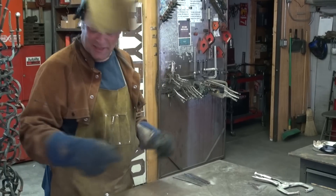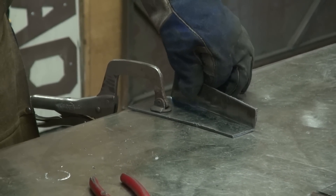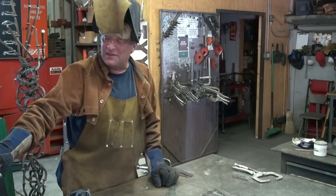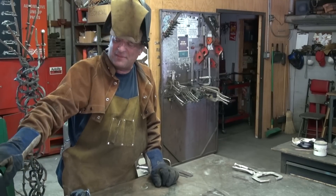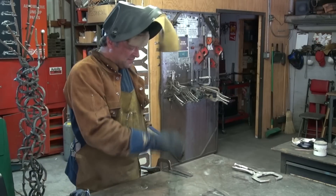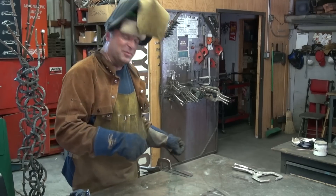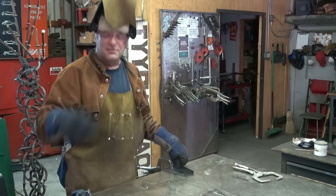Okay, let's play with a little 1/8 inch here. Let's do a little corner joint. Let me turn the welder up to about 5 on the volts and about 35 on the wire feed. I'll hold it up, we'll tack it in a couple places, see how it looks, take a few adjustments. Got your helmet? Yeah.